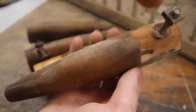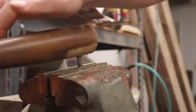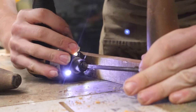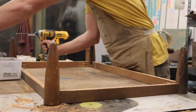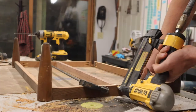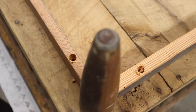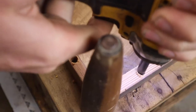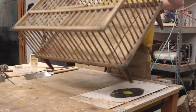The legs that I salvaged for this table already have a mounting bolt used to attach to the apron, but I really don't see me ever needing to take these legs off. The table's already pretty short — the legs are only a couple inches — it's not going to offer much portability. So I removed the bolt and used some pocket holes to attach the legs permanently. Any wooden table leg is going to have a square edge at the top — this is where you attach the apron. If you're planning on building a dining room table, don't use this table base as your model. I kind of just slapped it together. I'll do a video on how to build a nice proper apron and table base — if that's something you're interested in, leave it in the comments.